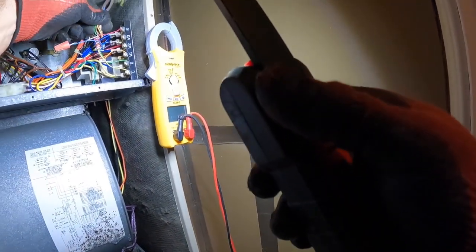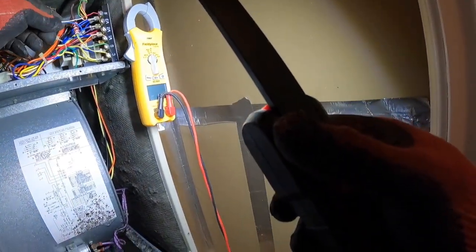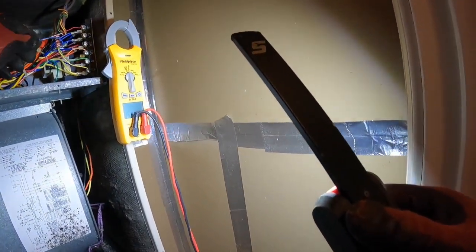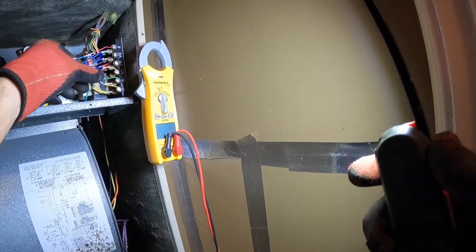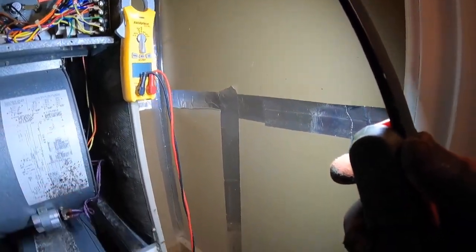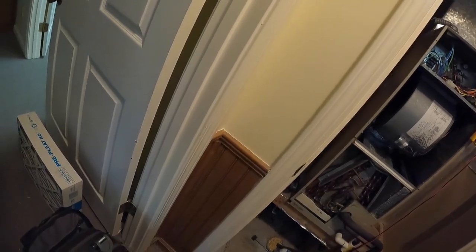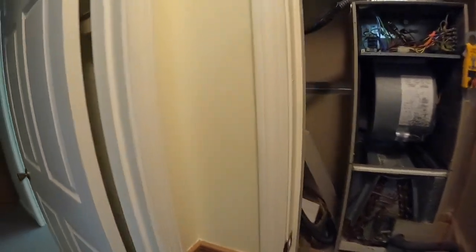So it's coming in, it's this one, and they broke R going to the thermostat with it, which is good. So it should make the thermostat go blank if the drain ever gets clogged. Basically, it kills the power to the thermostat. So we're going to put all this back together, turn it on, and check, actually call for cool. Check the pressures.